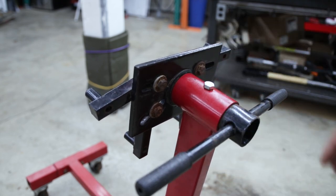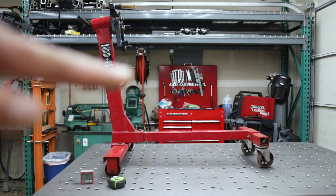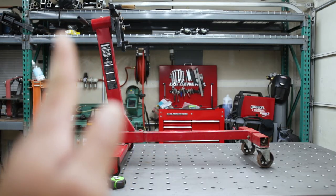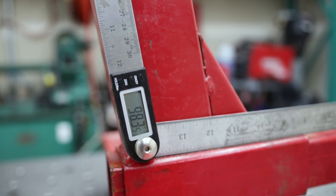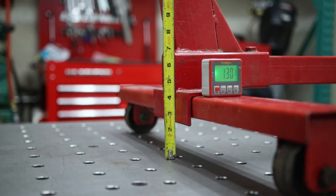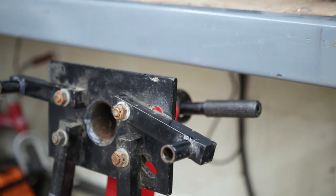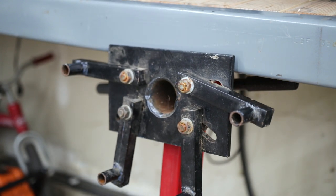It needed a few little tweaks to fit my needs. The main one was that this engine stand had a slight angle — I wanted to make that 90 degrees or perpendicular. It seemed like the back of the stand sat about a quarter inch lower than the front. And because I wanted to save some space in my garage, I wanted it to slide under and fit under this rack.